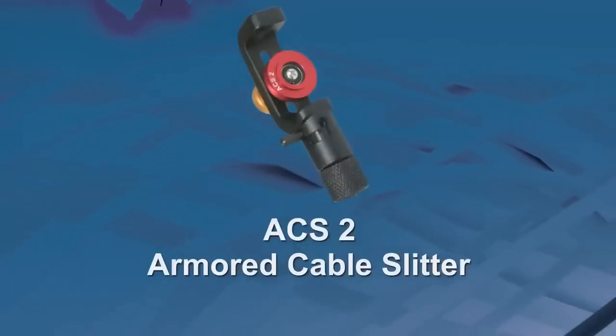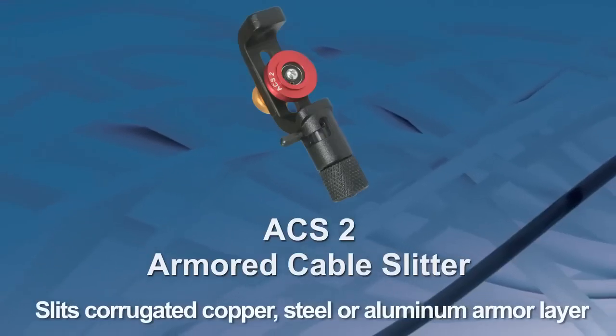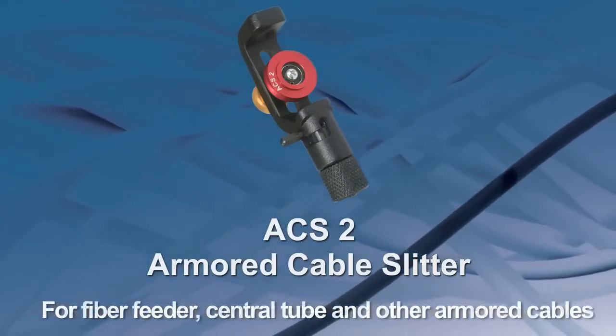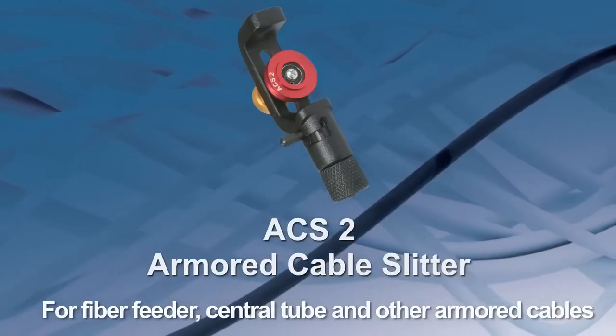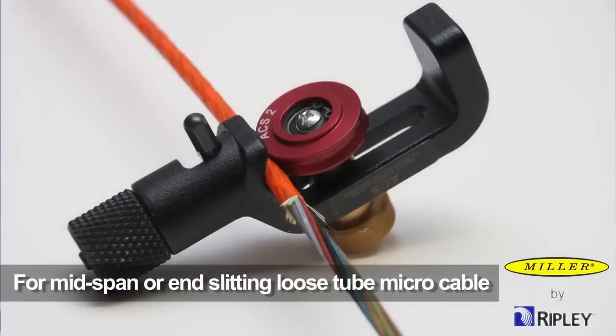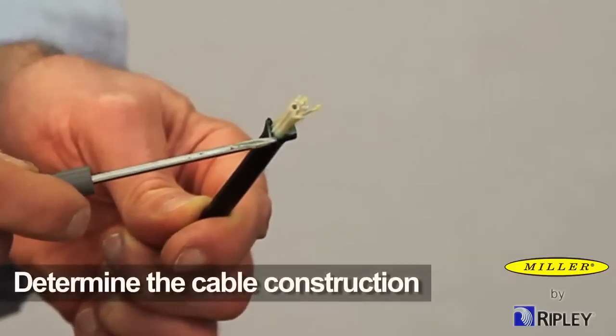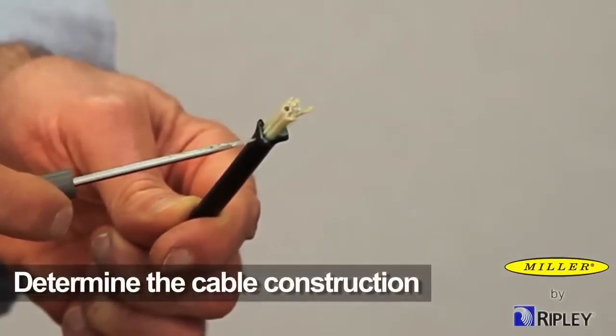The Miller ACS 2 tool is an armored cable slitter designed to slit the corrugated copper, steel, or aluminum armor layer on fiber feeder, central tube, and stranded loose tube fiber optic cables, as well as other armored cables. The ACS 2 cable slitter can also be used for mid-span or end slitting of the thin jackets on loose tube microcable, typically used in a blown fiber application. The ACS 2 tool is adjustable from 4 to 10 millimeters, or 0.15 to 0.39 inches, for smaller cable OD options. To begin using the ACS 2, first determine the cable construction.